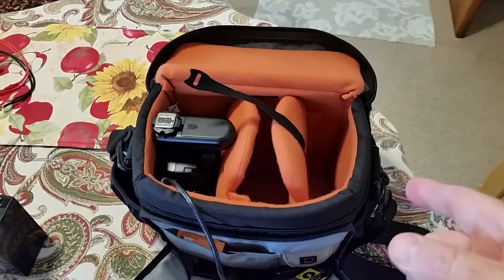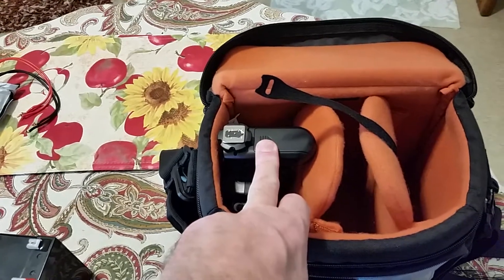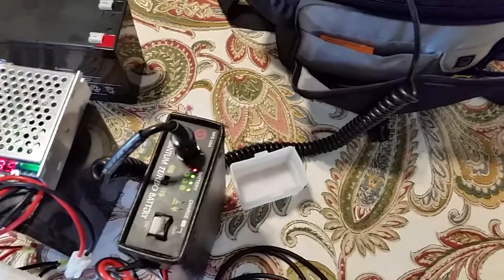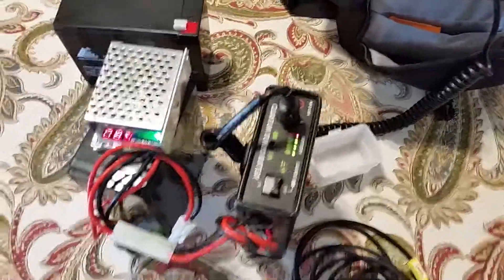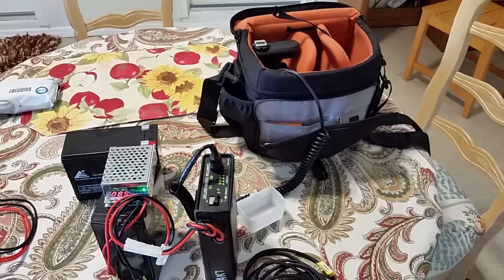Anyway, that's the story. I hope this helps. So it's a Lowepro Adventura 170 case, a Vivitar 285HV flash unit with the Yongnuo 603N Roman numeral II trigger, the DROK DC-to-DC converter with 3.5 to 30-volt input and 0.8 to 29-volt output, and a classic Quantum Turbo battery pack with wires connected to the battery terminals inside. I'm going to modify the other one I have — the battery's there ready to go. Hope this helps somebody who'd like to have a really long-life, portable, high-power flash. Thanks a lot for watching. Take care.